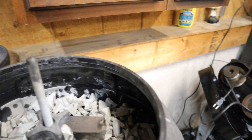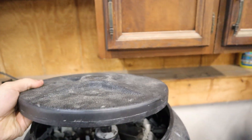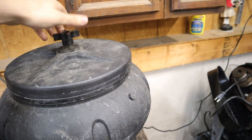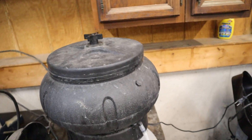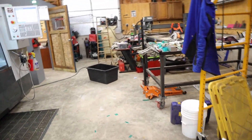This thing is super loud, so I'm just going to run it while I'm doing the CAM work because then I can shut the door. I've run the ceramic media with water before, but I realized if you run it with water and you do tool steel, it rusts like immediately. So we're going to do it with WD-40. The machine's all warmed up, so I'm going to go ahead and work on the CAM, and then we'll get right into this pry bar thing.